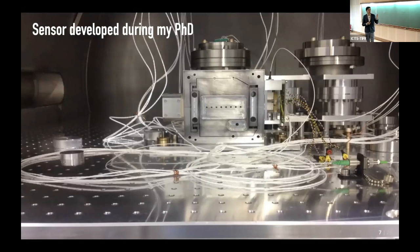Now I'll take you on a bit of a historic, personal tour on making Watts linkages with a sensitive readout — this was part of my PhD. Here you see the Watts linkage. A Watts linkage is a proof mass suspended by a pendulum and an inverted pendulum. A pendulum is a very stable system; an inverted pendulum you know because you've played with a broom on a stick — it's an unstable system. If you make sure there's just enough mass, or a little bit more mass, hanging off the pendulum than is supported by the inverted pendulum, you can make a system that is just stable — very soft, mechanically sensitive, low frequency.